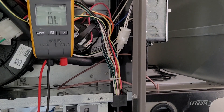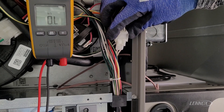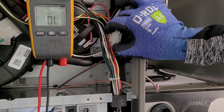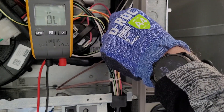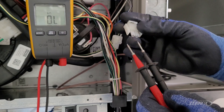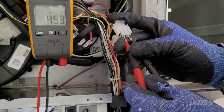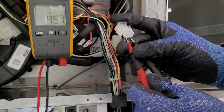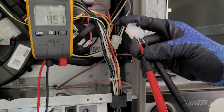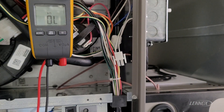We've moved up to the heating section of the furnace. The two-wire igniter lead has another Molex connection point here in the center. It's always a good idea to inspect these terminals, make sure the connection at this midpoint is tight and not loose. Pulling it apart completely isolates just our igniter. Checking resistance here, our meter reads 45.7 ohms — exactly what we read at the board connection — confirming that not only is the igniter good, but the harness is good all the way through.